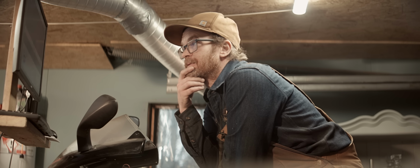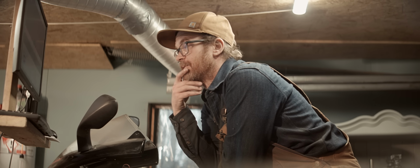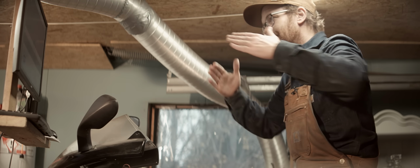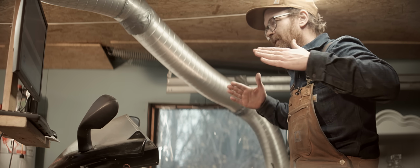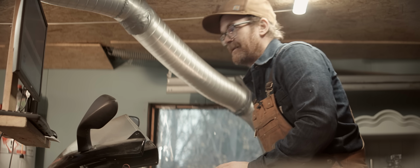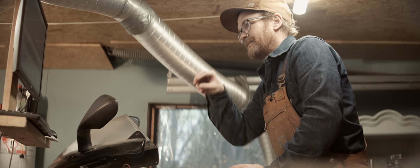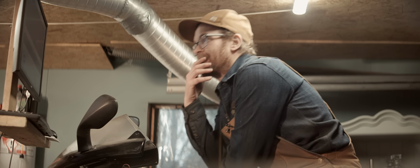Even though there's only the B transfers that could be. The A transfers are fairly normal, aimed correctly as they should have been when I designed it. The B transfers got aimed completely wrong. The rear wall of the B transfers were aimed far too much towards the exhaust port. I'm not sure what happened in the design process there, but they were supposed to be meeting in the middle. I had a center point in mind, and I definitely didn't hit that center point.